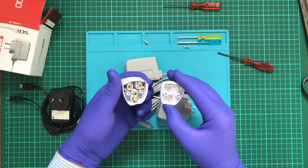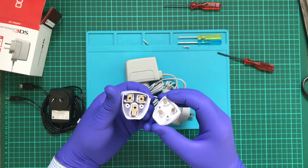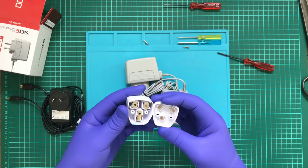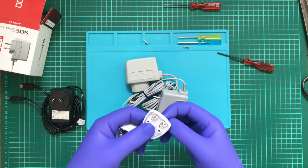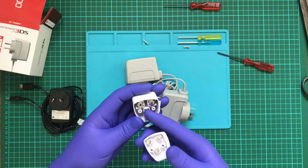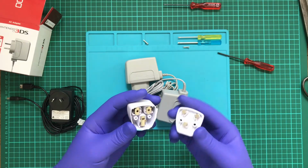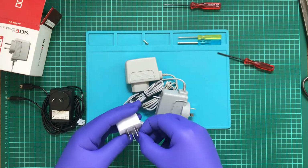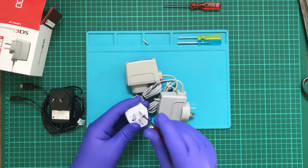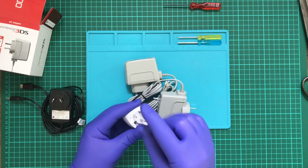Alright. The fact they're not connected is somewhat concerning to me. And the lack of isolation. Might be able to use those actually. But yeah, honestly, for me, I'd want to see more isolation between the actual contacts. I mean, that's just an air gap, and that can be quite easily overcome. Probably shouldn't put that back together, but whatever.